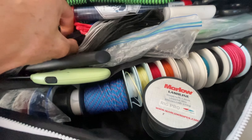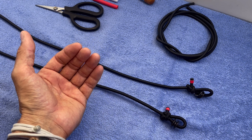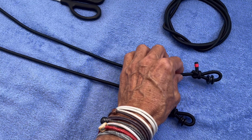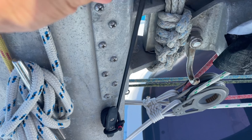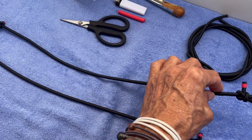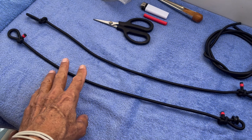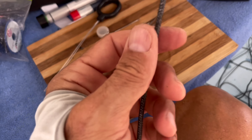So I've been thinking of what I could do to make them look a little bit nicer. Last week I came up with the idea of creating some nice flag halyards out of two millimeter dyneema. I'm going to put some shock cord on them so they're always under tension. We've got some little friction rings here — that's where they'll go around to pull them up and down — they'll work like a little block, and this end will go around the cleat.